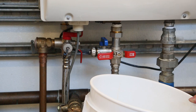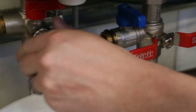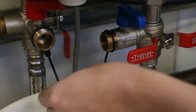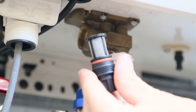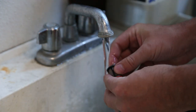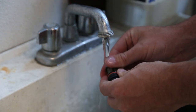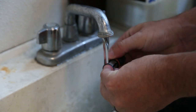With the bucket ready, remove the inlet and outlet drain caps on the isolator kits. Then open up both drain valves — be prepared for a bit of water to drain. Take the water drain valve with filter out of the inlet port. Clean the filter under running water to remove any debris, using your fingers to thoroughly clean the filter. Make sure the filter is dry before reinstalling back into the inlet port.